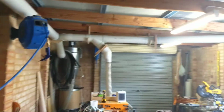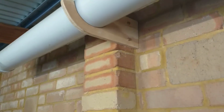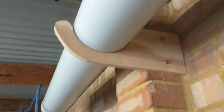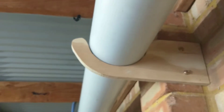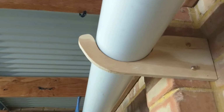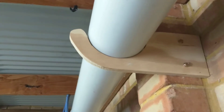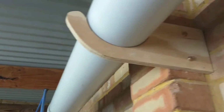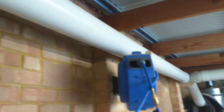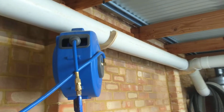The other thing I've done here is I've used a standard type of bracket, which I simply designed up in SketchUp. This wooden bracket here that you can see, I designed that up in SketchUp, and then I used Matthias Wandel's BigPrint program, and basically I could batch out a number of those supports, and then I anchored them into the wall, and you can see here that it's reasonably secured. They're plenty strong. The ductwork doesn't really weigh that much. It doesn't put much load.